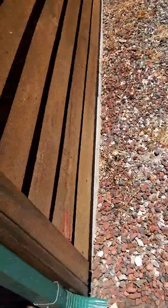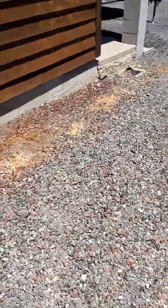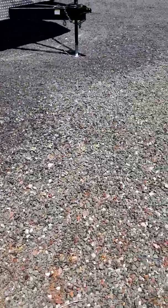So let's keep going around here. Like I was saying about the sill plate being flat on the slab, that's where you see the dirt. That's where you see the siding go directly almost to the dirt. Up here, it's built up a little bit. That's just based on fall, really. Not fall, but for level. So that's the high point. This is the low point.